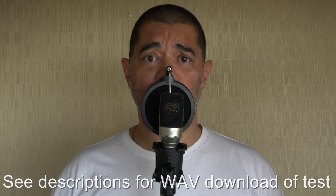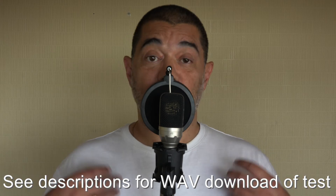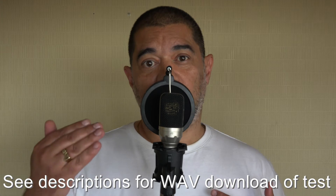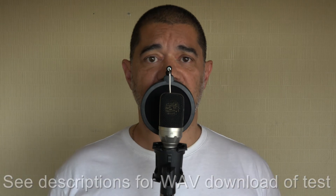As a for instance, I'm on an M71 right now, which is a Geffel, which is very susceptible to RFI. And right now, as you can hear, there's nothing there - that's because I've actually got this modified cable on it right now. I'll do some tests where I'm not talking, and I'll flip between a modified cable and an unmodified cable so we can hear what the difference is. I'll repeat the test again with the gain really high so we can definitely hear exactly what's in the background.